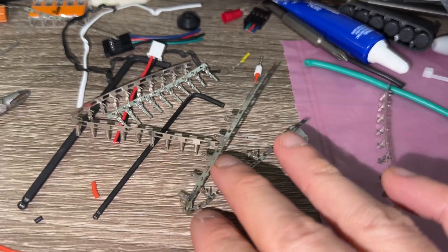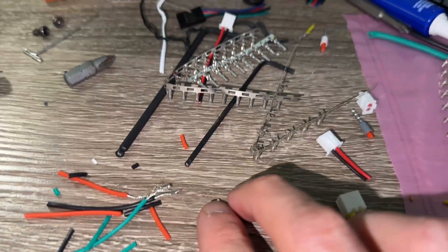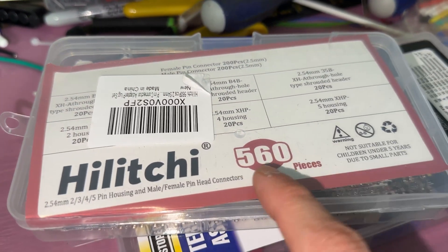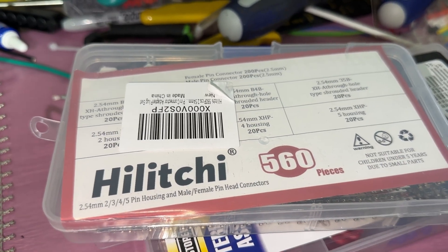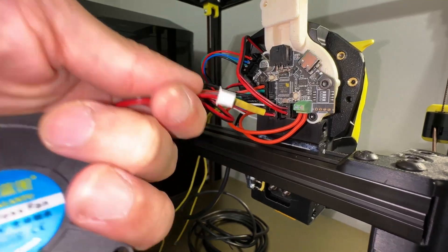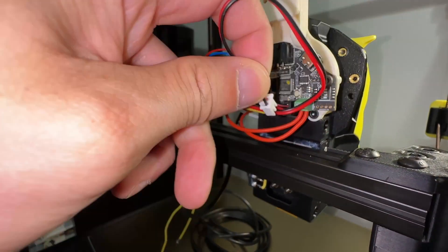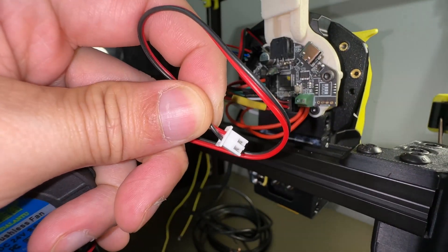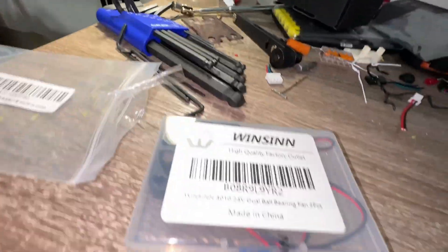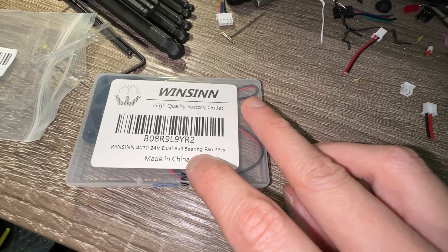I don't know why, but these crimp pins that came with the EBB36 absolutely suck. I could not get clean crimps with either of my crimpers until I used pins from the JST Amazon kit I've been using all along. Another issue is this 5015 fan, which is wired backwards, is noisy, and has a short life. This brand is the AI Trip from Amazon — I would search for a more reputable brand. Also, hot-end fans should be ball bearing and not sleeved, due to all the movement and vibration.